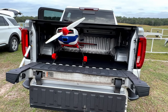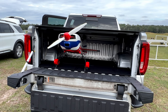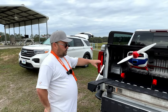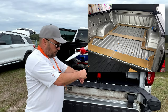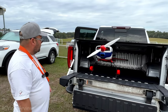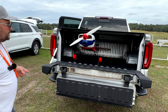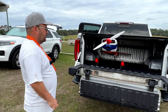So Dave, how did you put this thing together? There are many different ways of making the template. The method I used was to cut some cardboard strips about an inch or two inches wide, just start going around the edges and taping them together, cutting the excess all around. We also took measurements to make sure our template didn't move — each width dimension. Then we passed it on to the pegboard and cut them so they match.